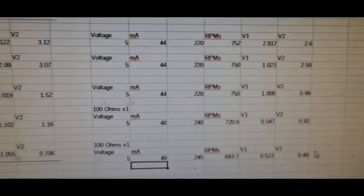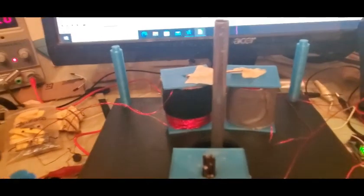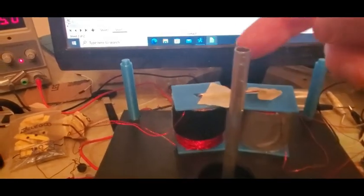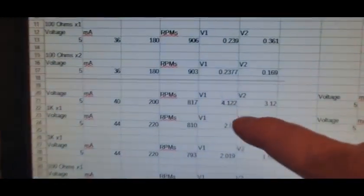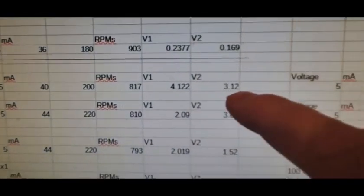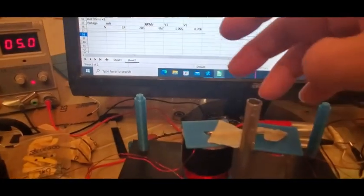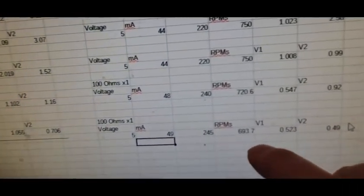So isn't that goofy and silly? I mean, we've mitigated spin loss, and just with one of those. Now, as I'm doing this, I'm thinking about why isn't it even better? And I'm pretty darn sure one thing that would improve it is if these coils were matched in terms of inductance. And they're not, because when they're separate, you see them doing that. When they're together, they're trying to equalize across there. And that means that the force going back here to help this one, and going that way to help that one, is not even. If it was even, I don't think we would have dropped as much as we did.